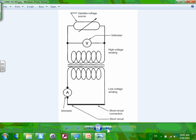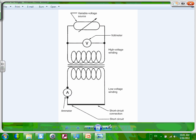The second thing that this chapter, guys, talks about is calculating the impedance of the transformer. Transformers have something called impedance. Impedance is important because it decides how much short circuit can come into my building. So if you look at this one, the way they measure the impedance, obviously this is just experimental. If it's a three-phase, you take one winding, just one phase, right? Here's the secondary. Suppose the primary was 480 and the secondary was 208.